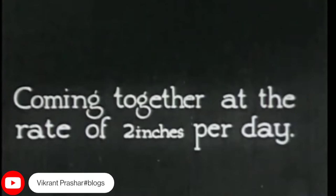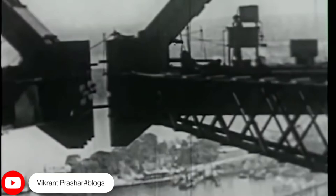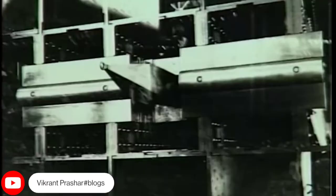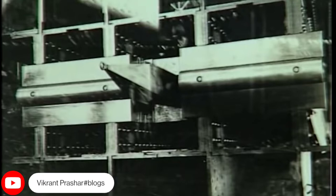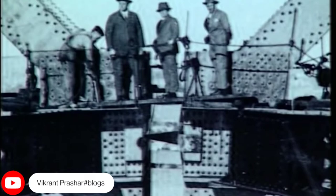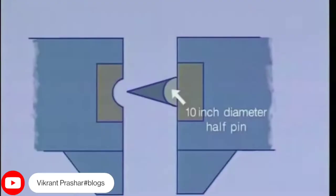There was a gap of about 3 foot 7.5 inches at 72 degrees Fahrenheit at that stage before lowering operations commenced. A temporary hinge arrangement was attached to the ends of the bottom cords, together with a tapered steel locating spike, which helped to align the two halves. When the ends of the cantilevers met, the temporary crown unit formed a structural hinge.